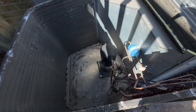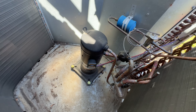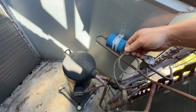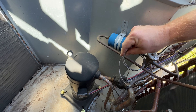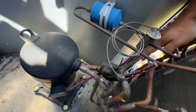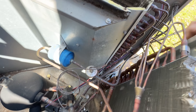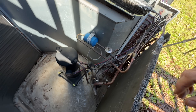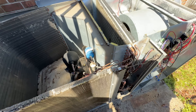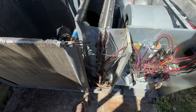Now is a good time to look everything over and make sure there are no potential rub-outs — any copper tubing that could be touching other tubes, check your wiring, make sure everything is zip-tied and not touching any other copper pipes. A quick zip tie can save the system from a leak. Everything looks pretty good here.